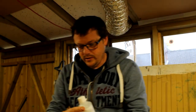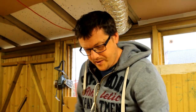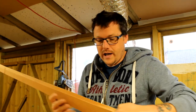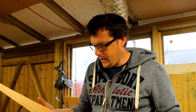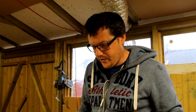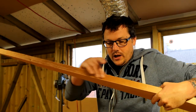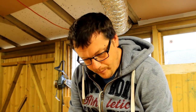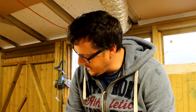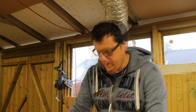What we're going to do now is seal, because this is a fairly soft wood. It's going to be quite porous, so we're going to seal with Glasscast 3. That's basically mixing up some Glasscast 3 and putting it on the edges of the wood. And then we're going to pour our main at the B stage today. We're not going to let it dry.